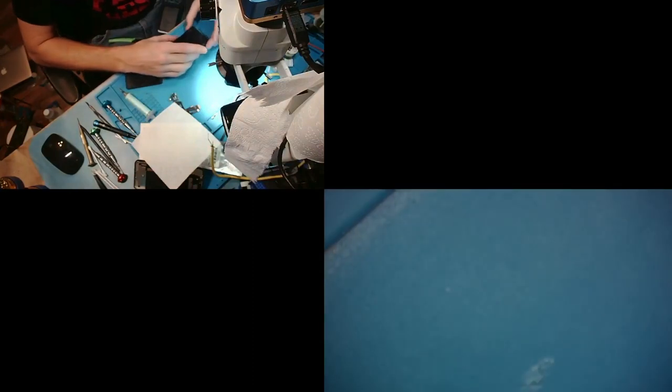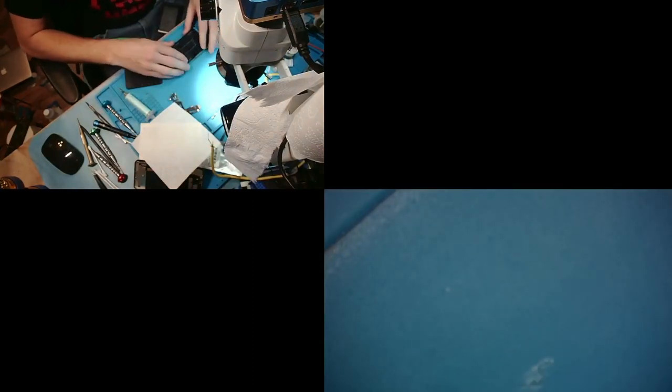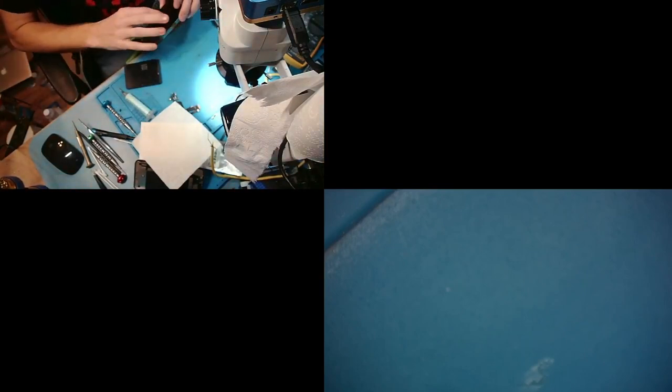All right. Now we will go ahead and put the stencil over top of the board. Okay, just like that. All right, we're going to make sure everything is good. Now, sometimes with this stencil, I put down a piece of Kapton tape just to hold down the stencil there on the edges. Just like that right here. Perfect, that kind of holds it flat.